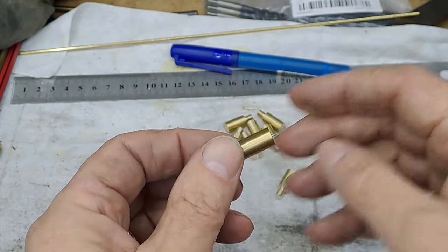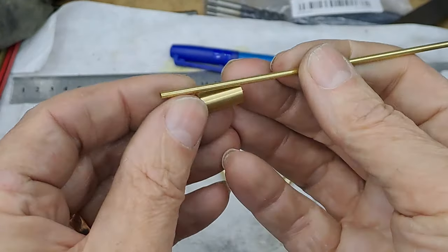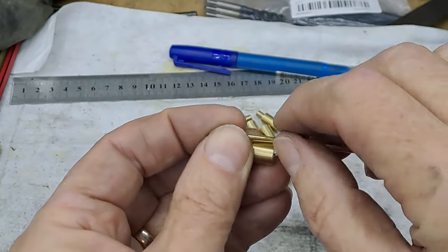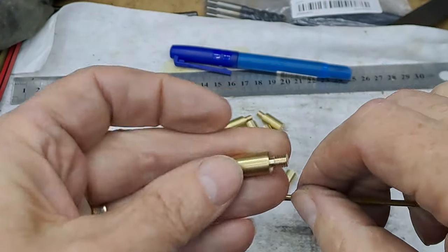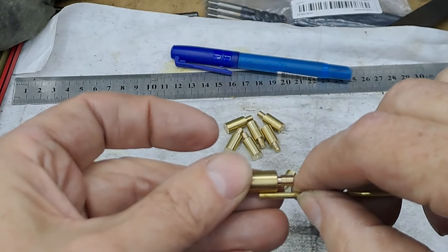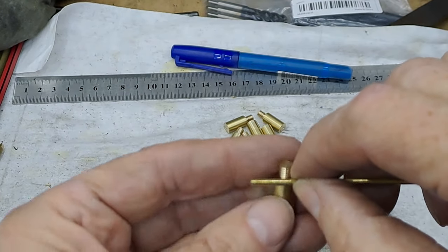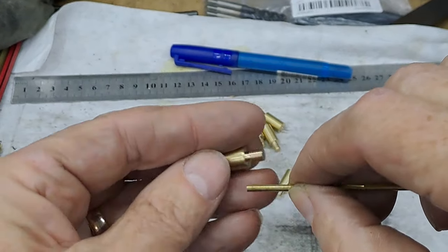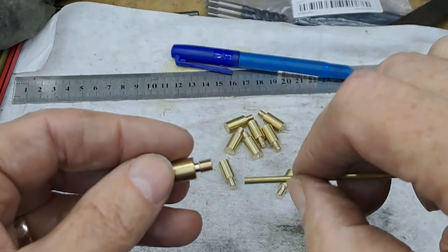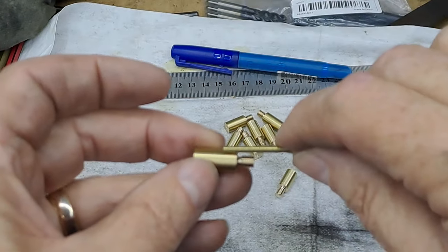We then have to, whether this tube will be a press fit or whether it will actually need a little bit of solder in there, just a little bit of household solder. This then goes in to about that far, and then I'm going to have to put a little bit of a wick in it. If it's a press fit, that's great. If it's not, just warm them up with a blowtorch, touch it with the solder just enough to lock it down, and then use the Dremel or something like that just to clean off the remainder of the pipe, and then just ditto repeato 10 times.